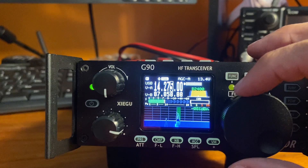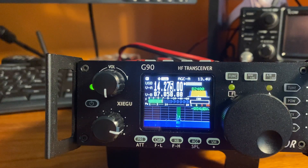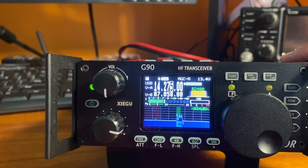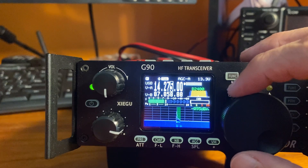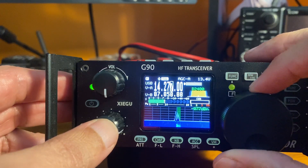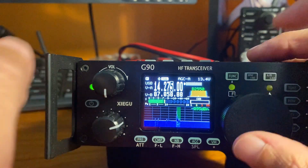The ground conditions here around Easter are notable — it's a three-day affair with a lot of rain, the ground gets super saturated, and I've seen telephone poles actually fall over and come out of the ground. The antenna performs pretty well from a receive standpoint. Next I'm going to disconnect it from the G90 and run it through my ICOM 7300 with FT8 to get a PSK reporter map and some signal reports. The balun is rated for 20 watts — probably 20 watt SSB — and I'm not sure that's the same rating for digital modes, so we'll run at about 18 watts.